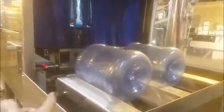Right now we're doing a runout mode of the bottles that we put in a few minutes ago. They're starting to come out of the washer. They get ejected, come down, and you push them up onto the rack, pull out that chute, and put it into the filler. I'm holding these two bottles back so you can see the full routine of how they come in. You've got two bottles just unloaded. Here's two bottles coming in. They come in the filler and hit the little switch. Over and over again.